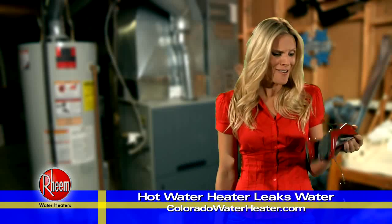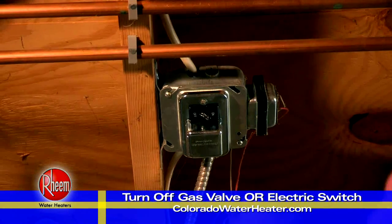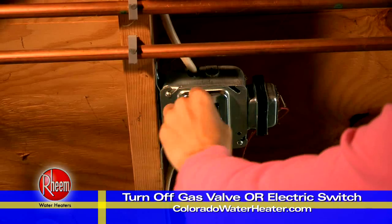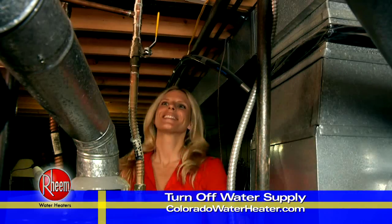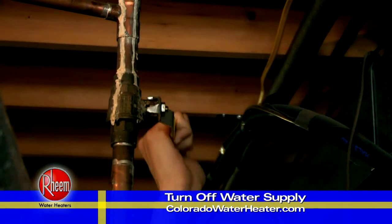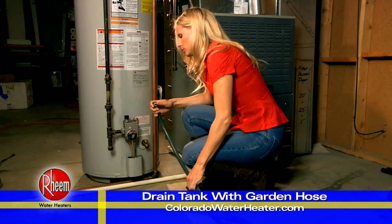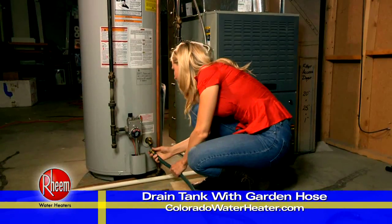The other indicator is that you're standing in your basement and your heels are being ruined. When your water heater fails, turn off the gas valve or electric power switch. Turn off the water supply by turning the cold water valve off. And if there is still water in the tank, drain the heater with a standard garden hose.